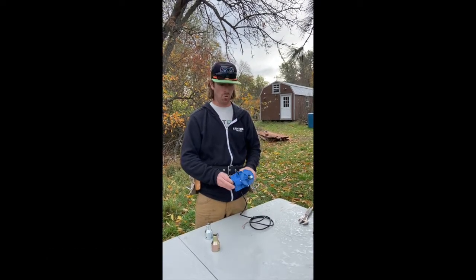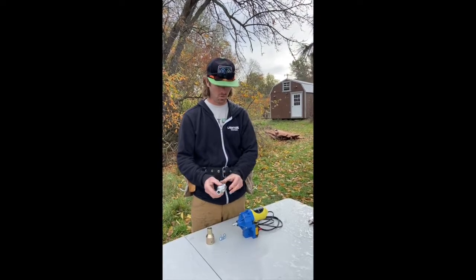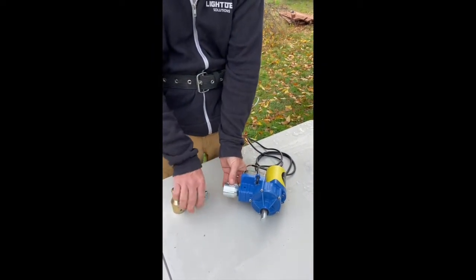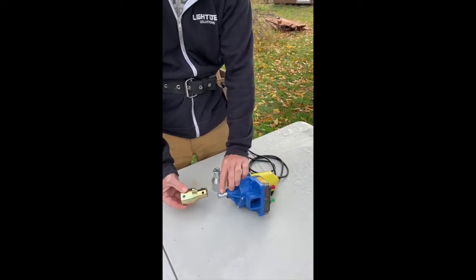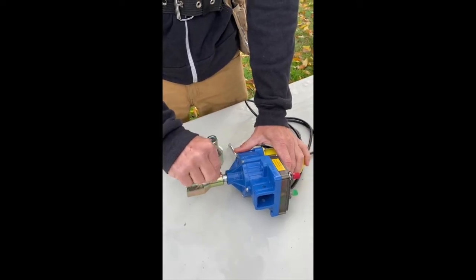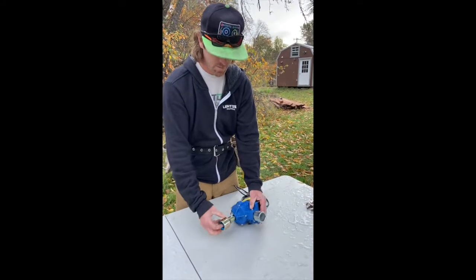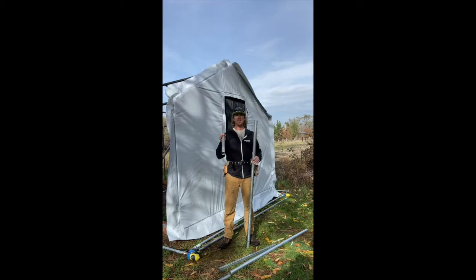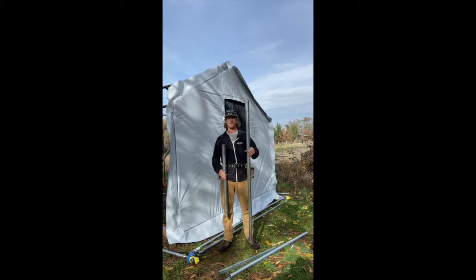Get your motor ready for the roll bar. Your motor comes with two adapters for your inch and three-eighths bar — one adapter has two holes and goes on the bottom using the long bolt to attach. The second piece has one hole and lines up using the bolts provided. You also want to remove the inserts. To assemble your pivot point, use a piece of inch and a quarter square stock about three feet long and a piece of inch and five-eighths four feet long — you can get an eight-footer and cut it in half. These are available pre-cut at Home Depot, Lowe's, or your hardware store.